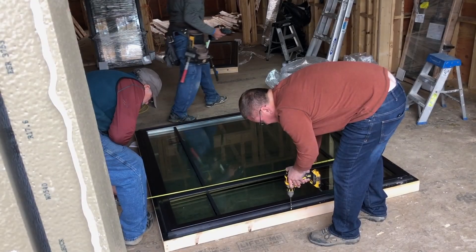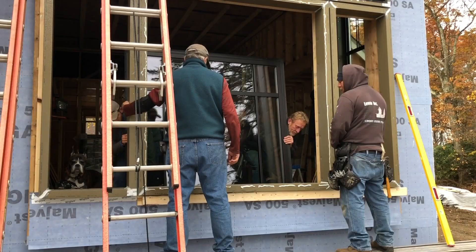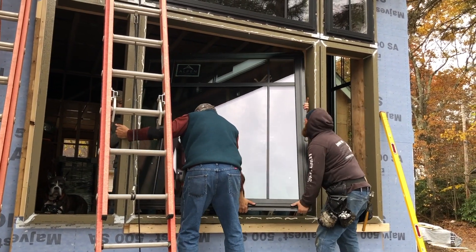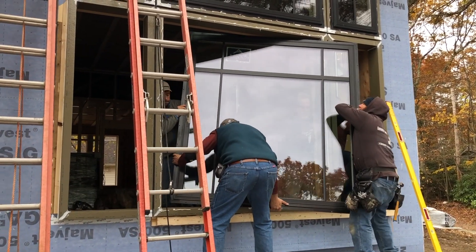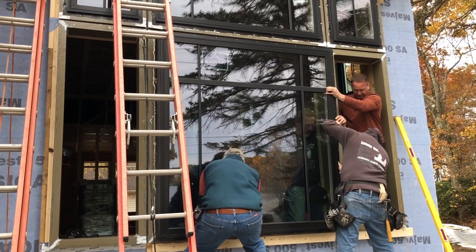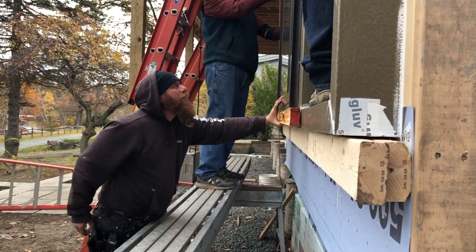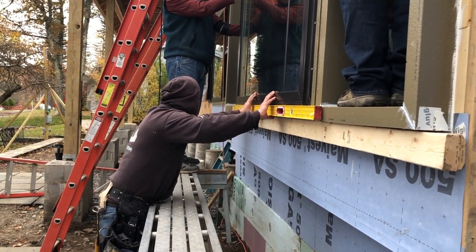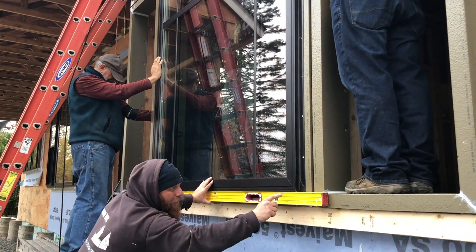I like the numbers in between. Five foot eight wide, six foot tall. I got a cup — I can switch off. When I got the side of the window, it's not going to tilt. All right, I'm off the cup. More towards the door. Bottom's in. Go up a sixteenth for now. It looks like this frame's got a little bow in it. I'm good from handle to handle, but I'm open on the end.